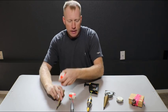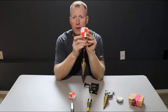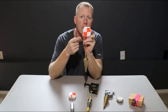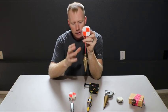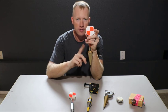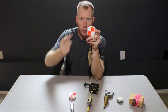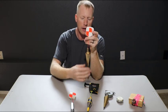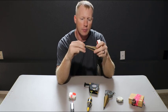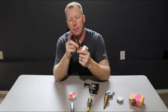The next step up is a real gammon reel. This one has 12 feet of string in it, and again it's a retractable adjustable reel with a target on the front for survey work. I have a 16-ounce plumb bob attached — it looks brass because it's brass-plated, but in reality it has a steel core. The top unscrews, you run your string through it, tie a knot, pull it tight, and screw it back in. The tip on this is actually replaceable in case you drop it onto a slab or piece of steel and bend the tip badly.